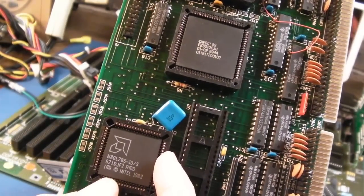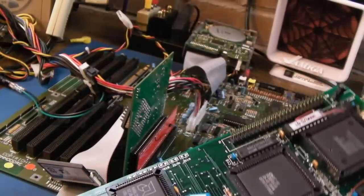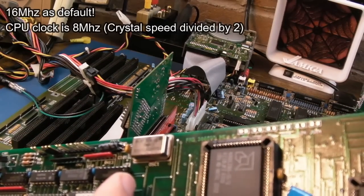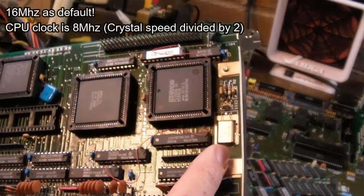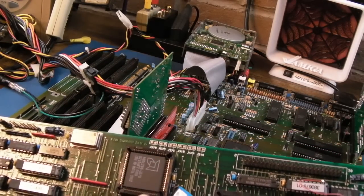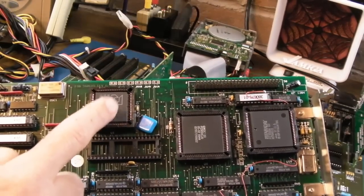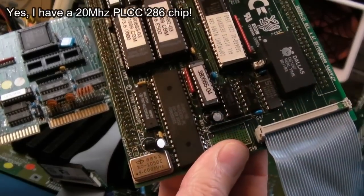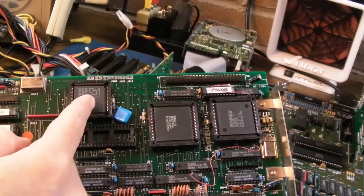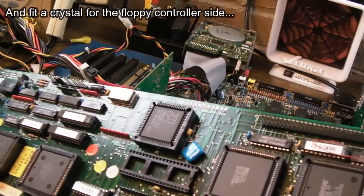You can swap this out. From what I understand, one of the crystals - there's a few on here - and the bottom line is you can change the crystal to, say, 20MHz. That may work on here; I think you can get these up to 25 in that package. It's a case of changing the crystal, changing the CPU, changing some jumpers, and then in theory you should be able to run it a bit faster.